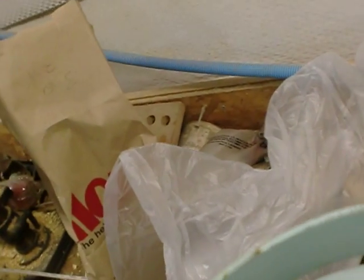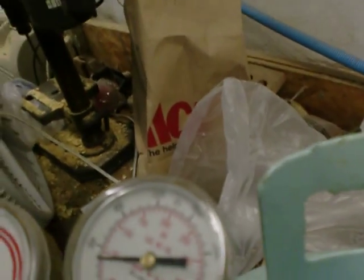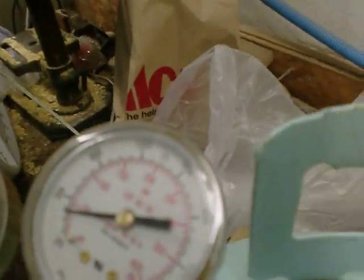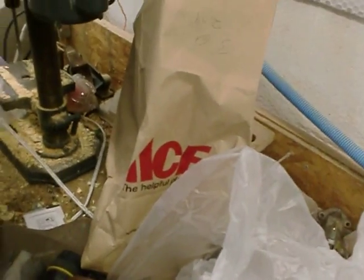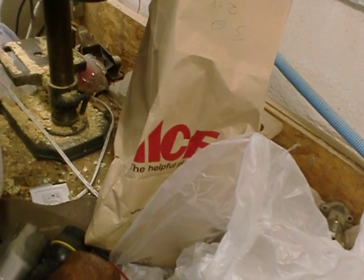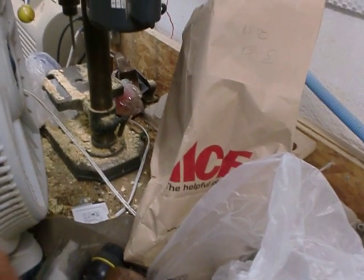I got a leak somewhere, because that fuel gas has leaked down from where it was. I'm using about 10 on there, and what I'm trying to understand is what pressure I'm supposed to use — if I can get by with 5, since all I'm heating is a half-inch bar.